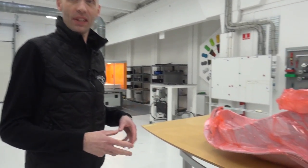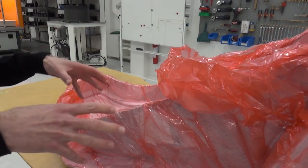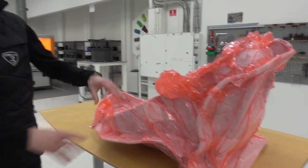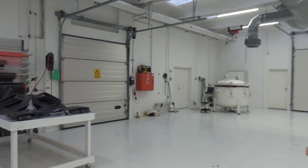After we've done all of the layers, what happens next? You have to vacuum pack the parts. This is one of your seats — it's packed here. You see all this plastic is basically sucked around the part, then it's inserted into the autoclave and baked. Once it's baked, you have to remove all this packing material. When the parts come out they look like what we see on the table over here.